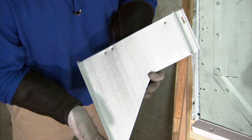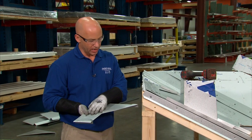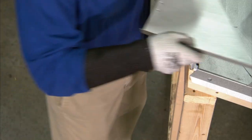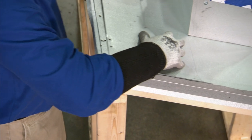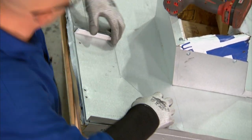I've cut my first panel and turned up the edge on the rake. I've got one inch tabs on the bottom, filled with tube sealant. I'll simply slide this panel into place, hooking onto the offset cleat.